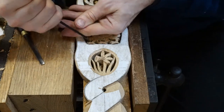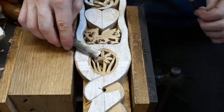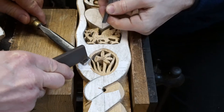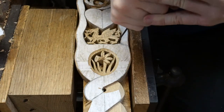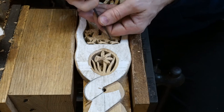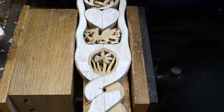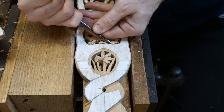I just put this chisel down. It's an Addis chisel, Dave. But if you want to just show that one. This is one of the ones we were showing earlier to show that we've got pitting on it. Which is something I'm afraid we can't avoid, because we're buying secondhand. There's a lot of pitting on the back there. I'm using the slip stone on this one. It generally has come from where the gouges have been stored before we've had them. If they've been stored in a shed or a garage and not been looked after, they start to get pitted. We've got one nice one and, unfortunately, that's all pitted. You see along the sides there. That's obviously been stored somewhere not really suitable. Well, we keep working on it. Eventually, we can get that pit out.